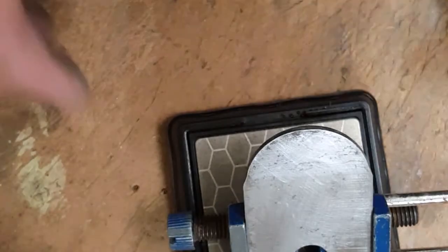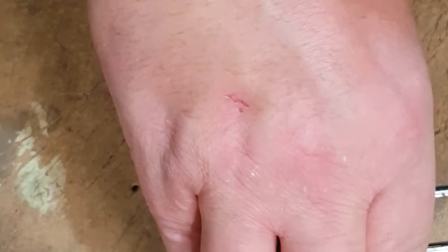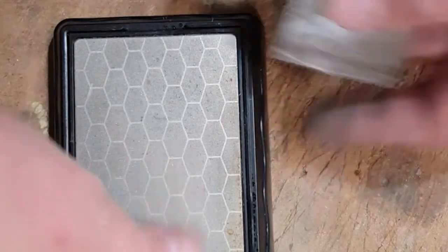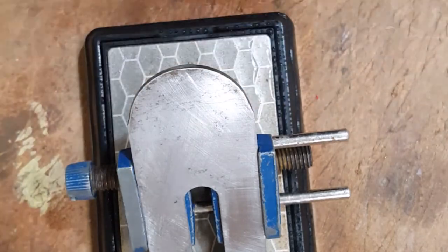This is a sharpening stone which I got, diamond. I think on this side it's 400. We just weigh it down, put it in the guide. Usually put it about, for these, it's usually about 2.5 centimeters. I usually go from the end of it. Gives it just a nice bit of edge off it, sort of like the cutting side of it. So we just give it a good sharpen, really. Just keep on going backwards and forwards until it cuts like a new blade.